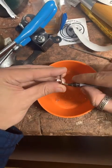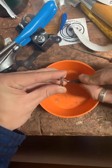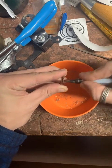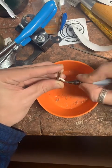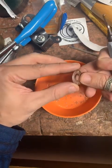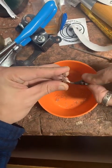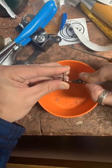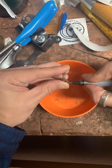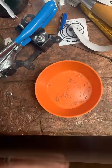Yeah, I like that one a lot. Unfortunately, they don't make any Susan B. Anthony in silver, so that has to be a copper coin ring. The biggest I can do quarters before they start looking weird is a size 13. So that's the biggest I offer. After that, the band starts thinning out in places, and the chances of it snapping are super high. So I don't even think I could get one to a 16. The Susan B. Anthony's a size 9.